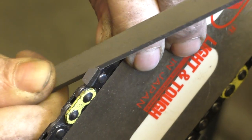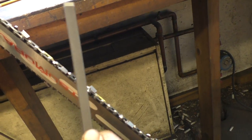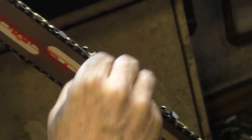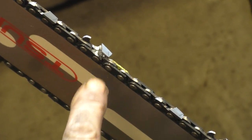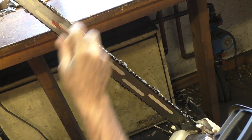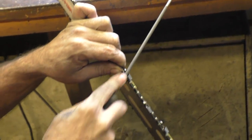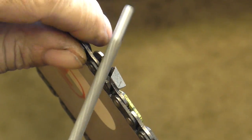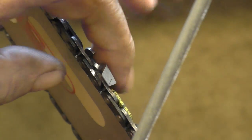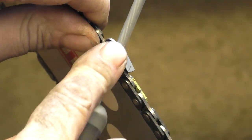I'll just do a couple teeth here. It's square, I'm just not low enough on the back. I'm not getting my file under the tooth at all — it's kind of up here. I don't have any hook into it up here. You need to be filing down into your side strap. You're not filing your side strap; your angles aren't right. The more that you can take out the round file out of the gullet, the less you have to fight that metal with the square file.